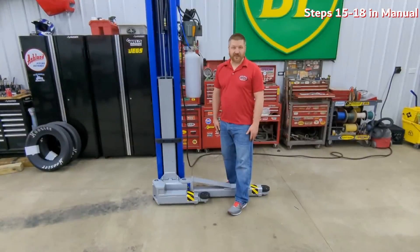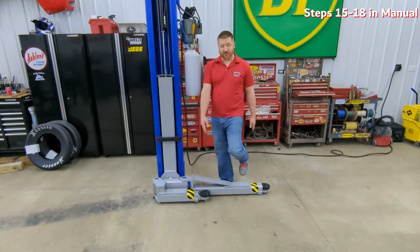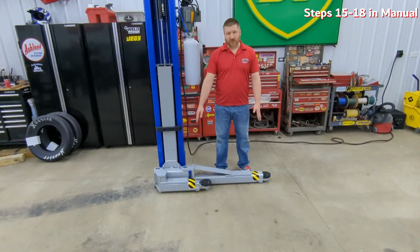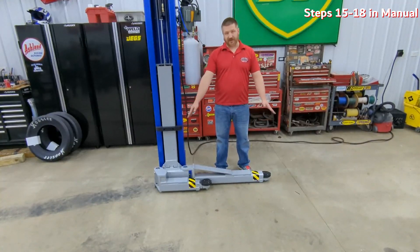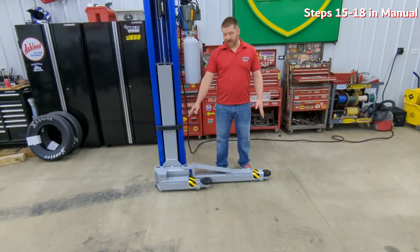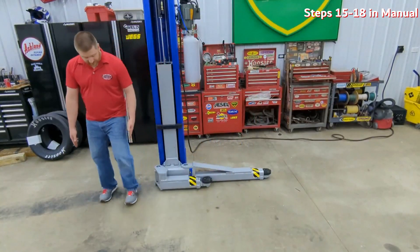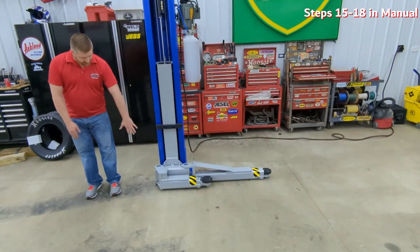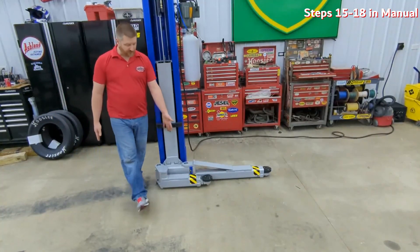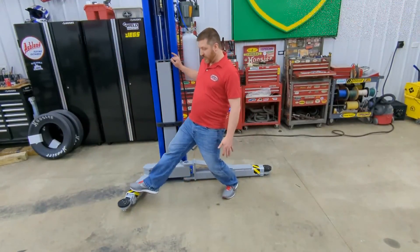This Race Tools Direct 11,000-pound two-post lift has what we call bi-symmetric arms — it has an asymmetric-style front arm with a shorter front arm and a longer rear arm. That allows you to shift the vehicle further back between the posts, giving you more room when opening the doors. For a short wheelbase vehicle, with the arms straight out you may have to push the car forward to swing the arm back. Starting with this arm to the rear, you can easily swing it from behind the front tire into position.